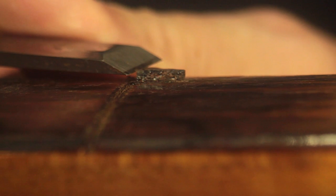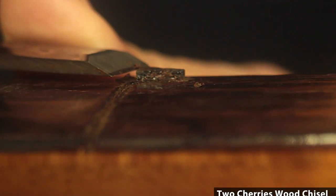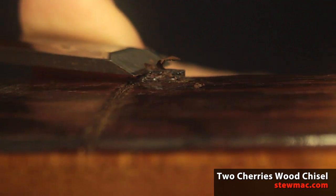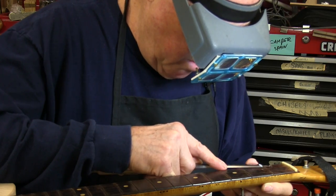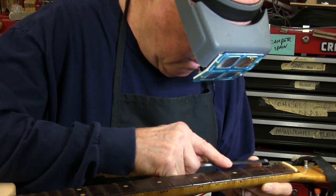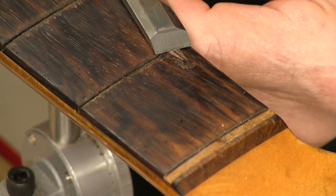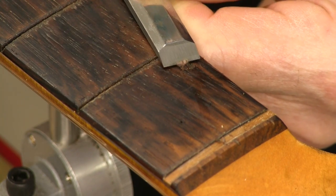I'm not sure which way the grain's cutting on this yet, so I'll just do little bits at a time and go from a lot of different directions. You don't try too much because it can run out on the grain and dig down deeper than you intended. Watch that black stripe in the center — it may change and it may not. As it runs through the grain it runs at angles and switches directions.